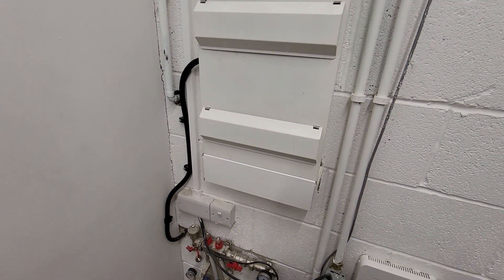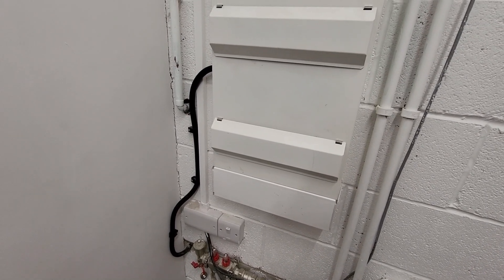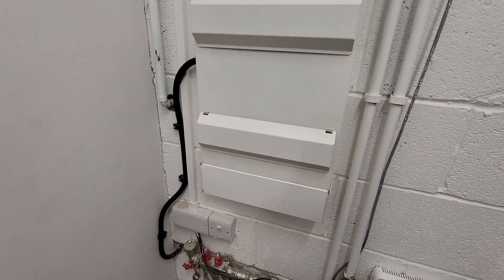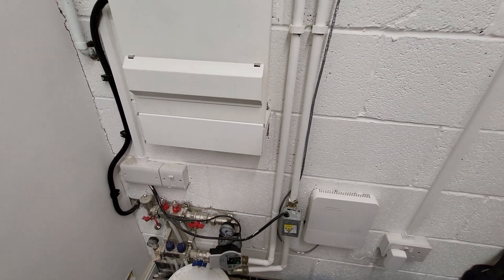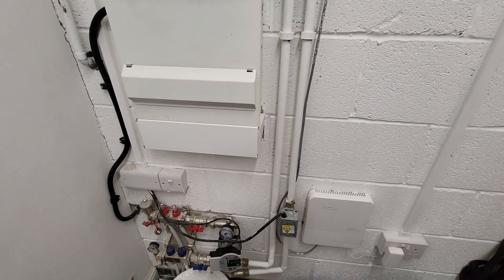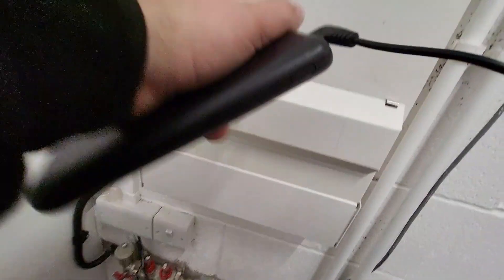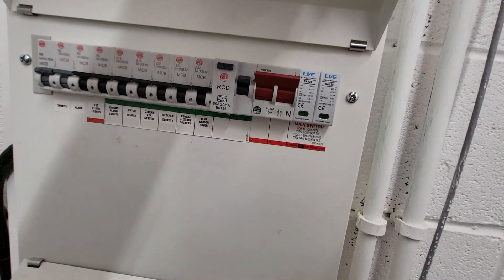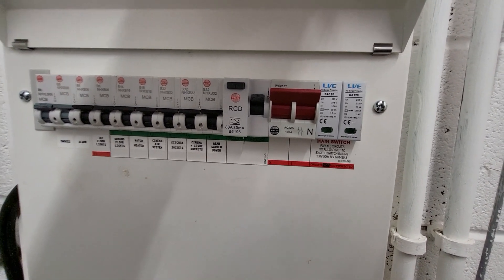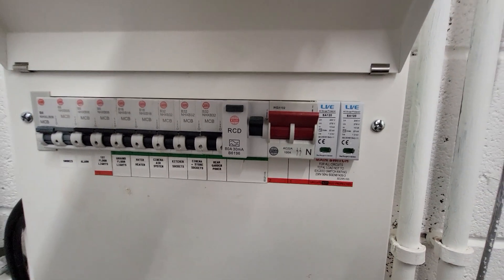There you can see our cable brought through - we just need to do a bit of hoovering up in here. I've tried to keep it away from the gas pipe as much as we can, there is a gap there coming across. It's tied in nice and straight to the trunking and then landed in the side of this CU. It's just a bit cramped for space but I think that's about the best we could do. It's a Type A RCBO with the neutral being switched - that's good enough for us, and I'll speak about that a little bit later in the video.